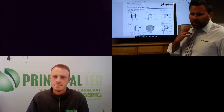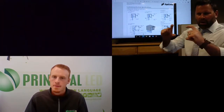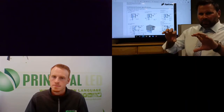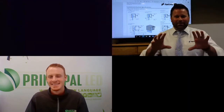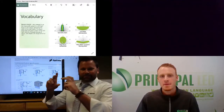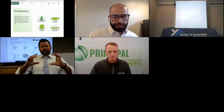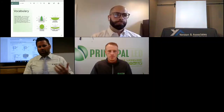You know, Jordan, since Joe took that retainer off, I did have a question about the layouts. By having all the rows and modules in line with one another, do you think it'd be better off to stagger those, so we're getting full illumination? I'm using a lot of hand motion here, but if we have the modules all next to each other and we draw a circle where those beams are coming out, there's going to be a dark spot in the center, no? Whereas if we offset those, now you're getting full illumination across the board rather than having that little dark spot in the center. So yes, I agree with you, but at the same time, it depends on the LED and the optic that you're using.